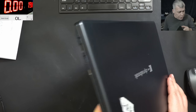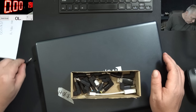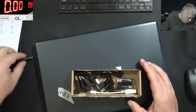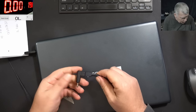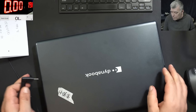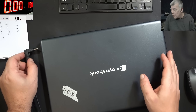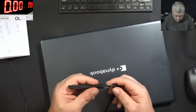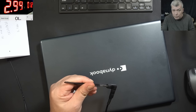First, let's plug a charger and see what it's doing. We need this kind of plug — that's the one. Now let's see how we can check if it's charging. The people are saying the laptop stops at 35%. Wait, my power supply clicked. So we don't have enough current, or something is very wrong with the laptop.